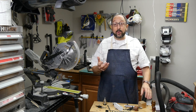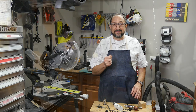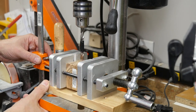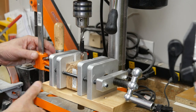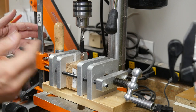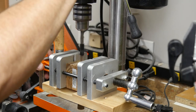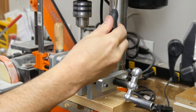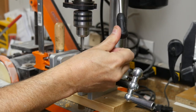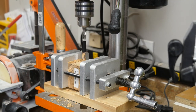Let's go to the drill press. We will drill a hole, tap that hole, and get started turning our wine stopper today. We're here at the drill press. I have the block of wood in a vise, and that vise is clamped to the bed of the drill press. Safety first — I wear glasses, so I'm not putting on separate safety glasses, but you do need your eyes protected. We'll power on the drill press and slowly lower it into the block of wood, lowering it down to the mark.